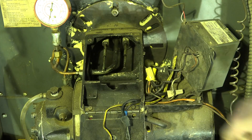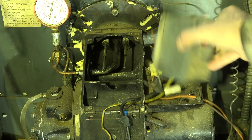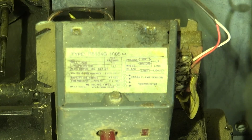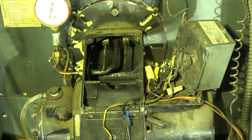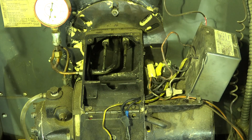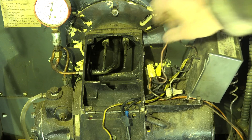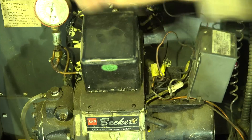For wiring, there's only two wires to consider — not the flame sensor. One wire goes to power coming in and the other wire goes to the output of the CAD cell relay. Right on top here there's an orange wire that comes out, and that's the one that goes to the transformer. In this cobbled-up mess there's an orange wire coming off the CAD cell relay going straight to the other wire on the transformer. It doesn't matter which wire is which — just hook one to power, that'll be the white common side of line, and the other one goes to the orange or whatever color the CAD cell relay diagram says is for ignition. Bolt it down, test it out, you're done.